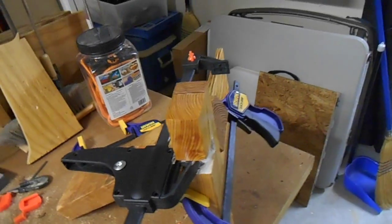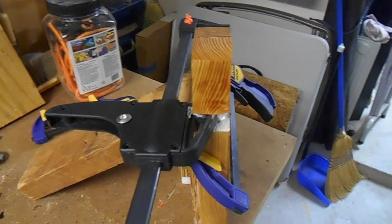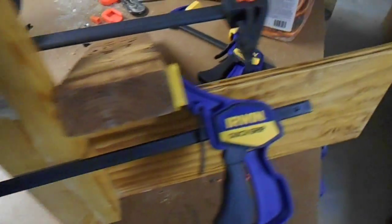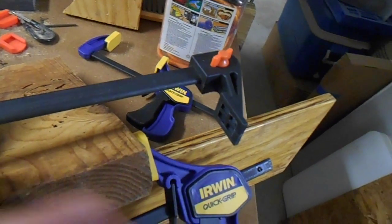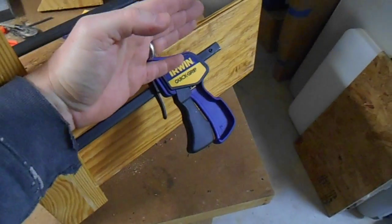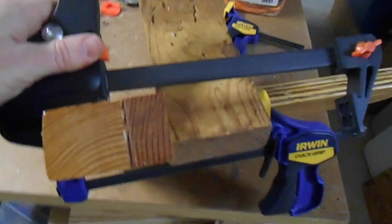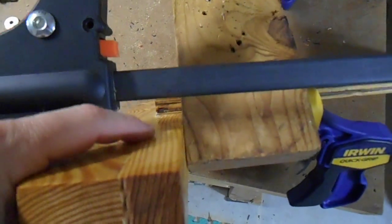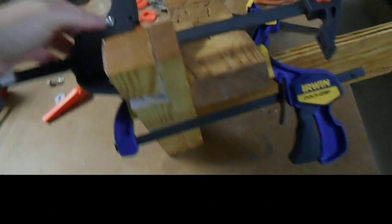I don't know if I can recommend this jig yet — I haven't used it enough to be sure. I do know it made it a lot easier to deal with the circular saw. It works a lot better than a speed square in terms of stability, and it makes it a lot easier to hold and handle. The only other modification I'm going to have to make is to shave a bit off the end clamp because it's too low — the rubber tip was catching and sticking down too far when cutting pieces flat on the bench. In retrospect, I should have mounted that portion of the clamp body a little bit higher so the tang was flush with the top edge rather than the bottom. So, modifying as I go. Experiment continues — I'll keep you posted.